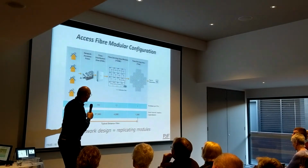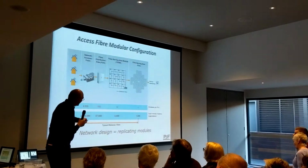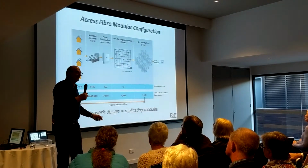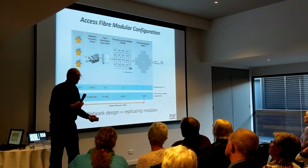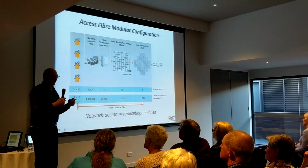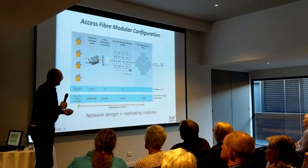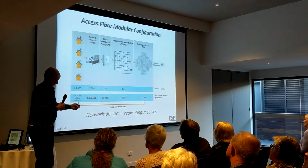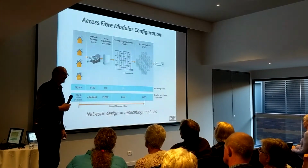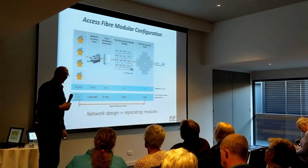Now, if all of the network came back to the actual fan site, then you'd need 38,400 fibres all the way back. And the space to actually put the connection frame was too big to fit in the exchange. So with the Telstra deal, NBN Co got 16,000 rack spaces in 1,000 exchanges to put equipment. That's rented. Again, that's part of the deal. So that's where the electronics goes in the fan site, and the other part of the electronics is actually in your house. So technically, when in the box outside, it goes from 32 to 1, it's still passive, but it's no electronic.